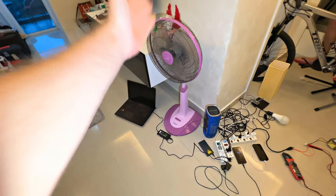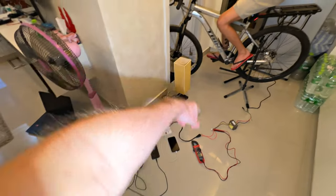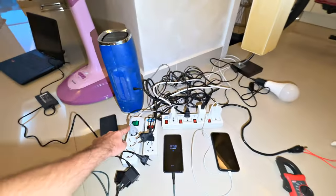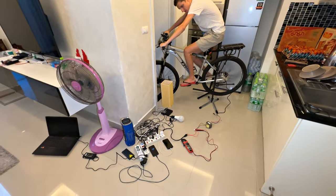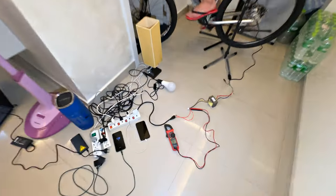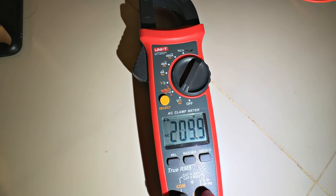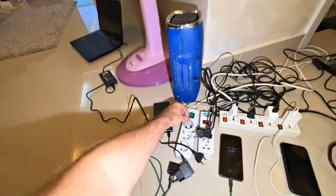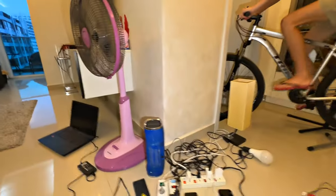Our task is to check how many consumers can be powered from the bike generator at most. We have a laptop, a fan, a Bluetooth speaker, two smartphones, a power bank, and two table lamps — 8 consumers in total. Now we will connect one at a time and see how the load changes and how hard it is to pedal. The voltage is a little unstable but it is not dangerous for the consumer — 228 volts. We turn on the fan first — it started working immediately. That's enough tension.